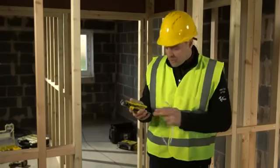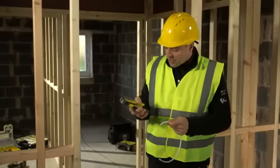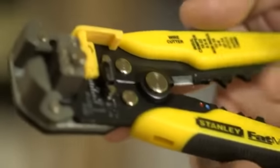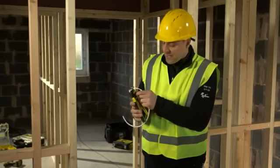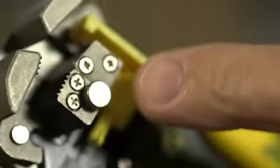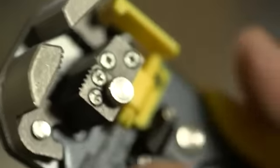This has other features as well — you can use it for clamps and crimps, whether insulated or non-insulated. You have a wire cutter that just snips through your cable like so. The clever end, which is the stripper, is fantastic. You also have a guide on the side that's quite easy to use — just move the guide across, put your cables up to it, and they will cut exactly where you need them, so every cable is cut the same.